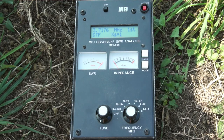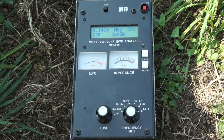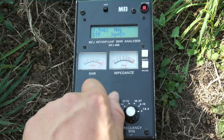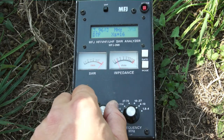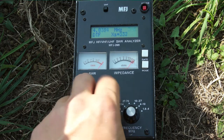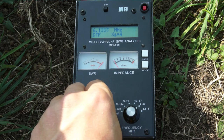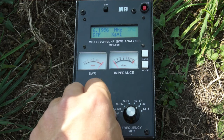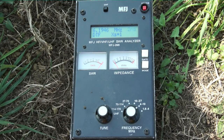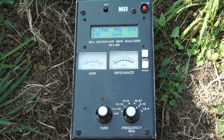I'm going to press gate to lock that in, and now it's started flashing 'second,' so we need to go up through the frequency. We're as high as we can possibly go, so I'm going to go back down to the bottom of that band and start again. It's risen to 16, so it's rising from where we left off. I'm going to keep going up until that figure starts to drop again — going back down to zero or one. If only one of those goes down to zero it's no good; you need both impedance and XS down to zero.